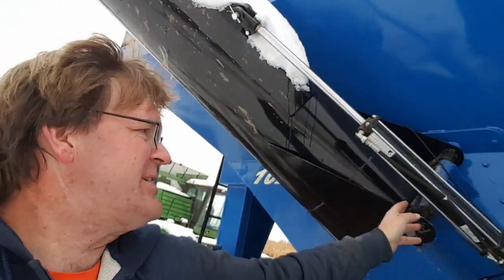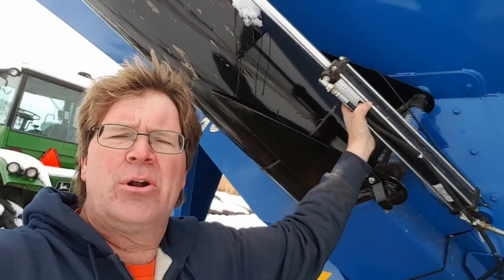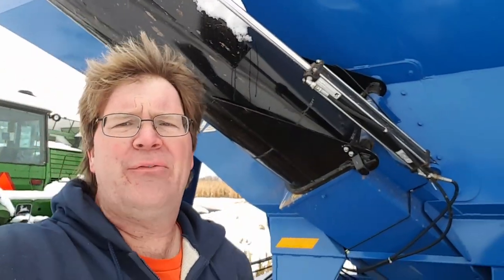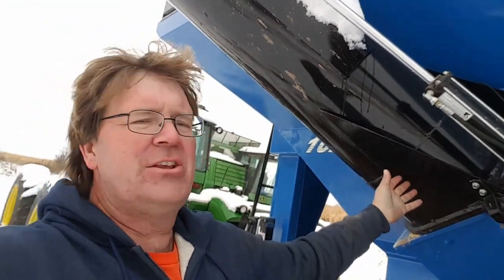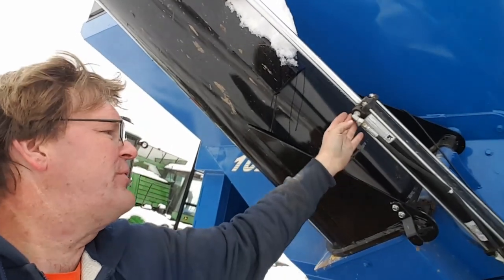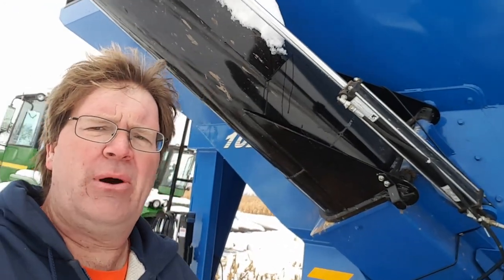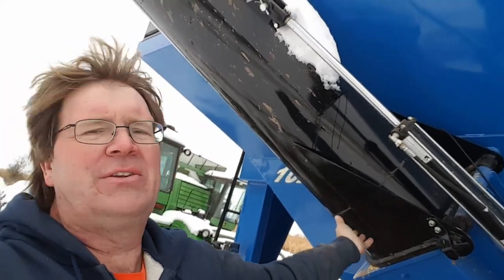The only complaint — and Easy Trail is watching — is this cylinder. This is a two and a half inch cylinder and we're going to put a three and a half inch on there. The two and a half, when it moves it, moves it kind of fast — faster than I like to see. And then at this point of being folded out, the cylinder is very parallel to the auger, so it has a hard time. Right now, once in a while we either have to back up and bump the brake or bump the PTO to get this auger to fold over. Other than that, that's my only complaint.